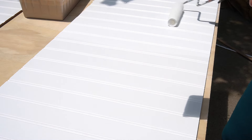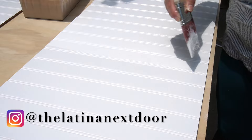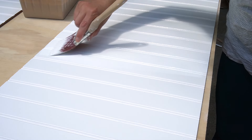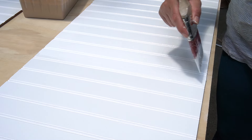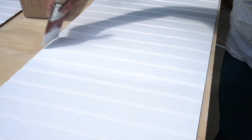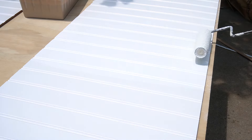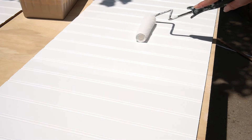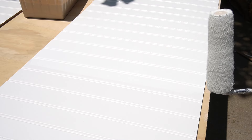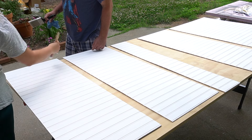Now that you have an idea of how you should be putting them up on your wall, I do suggest painting it prior and giving it one coat. This beadboard is a little rough and even a bit porous, and sometimes as you're installing it you can mark it up. So I suggest you go ahead and paint it. I'm using the same paint I use for my kitchen cabinets — my tried and true Emerald Trim Enamel by Sherwin Williams. In the kitchen you do run the risk of getting food and splatter on your backsplash, so I do suggest using it in semi-gloss as well. This is highly wipeable — you can even use a magic eraser on this paint and it will not damage the finish, and of course you don't need a top coat. I like to go with a brush and get all of the crevices first, and then smooth it over with a nice smooth 4-inch roller. If you haven't seen my video on how to paint kitchen cabinets, I'll link to that tutorial in the description box and above as well.